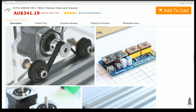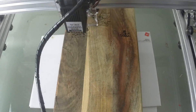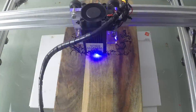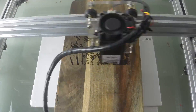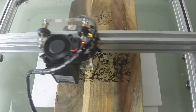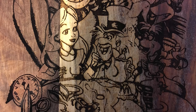It runs the Arduino Nano, and mine happened to come faulty. The issue was that pin 11, which controls the laser on and off pulse, wasn't working on the Arduino itself, meaning the laser was constantly on. So every time it did a crossing between one side of the picture to the other, it would leave streaks and lines all over the image. GearBest was obviously going to send a replacement, but it was quicker for me to just buy one locally for about $10, and the machine has been running like a champ.